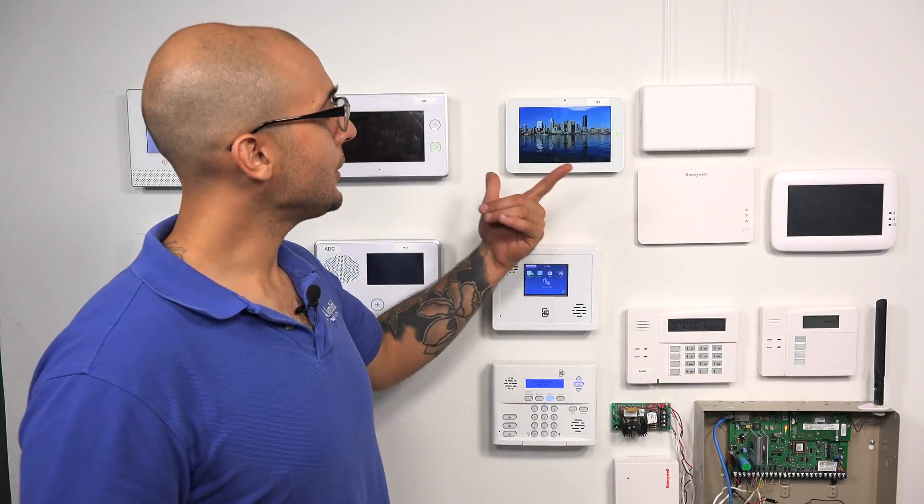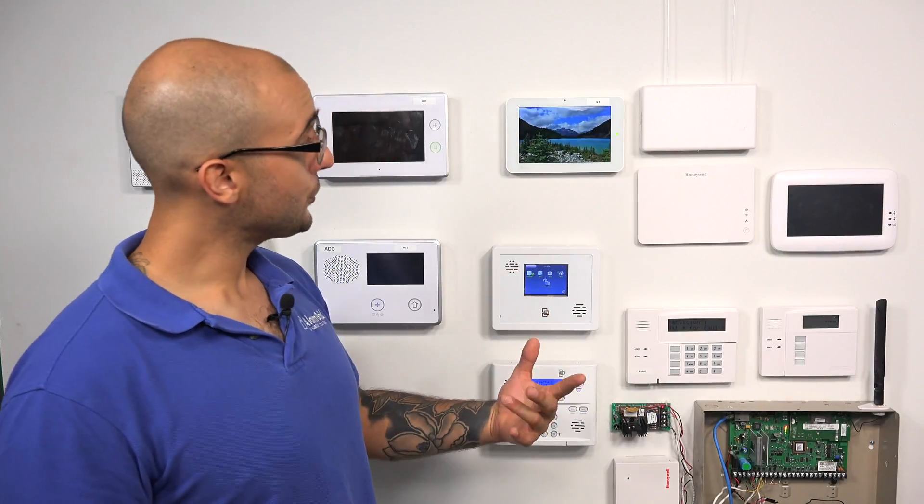There's one other option going forward. This isn't for people that already have a Qolsys system, as these daughter boards aren't going to be released to be individually installed in the systems — they're going to come with new panels. The IQ2 has three slots on the system where Qolsys said they're going to be installing daughter modules. What these modules are going to do is allow the system to work with specific sensors. So instead of installing an IQ Translator to convert all the 345 frequency sensors in the house, you could purchase a Qolsys IQ2 with the 345 daughter board module already installed, and then those sensors are going to work right with the system.